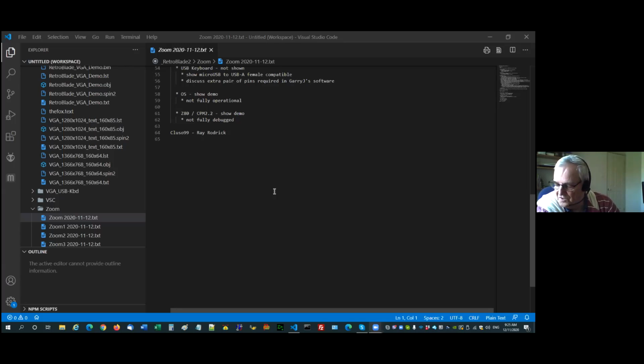Also, just to make sure it doesn't boot from the flash, in case you've got code on there, if you set switch 3 on, which pulls P59 high, it will stop it from booting. Now, I think when you stop it from booting, the P2 eval works. I've got it, but on my board I don't have that optional pull-up. And if I've got an SD card in there without the boot file, so underline boot, underline p2.bix, or the boot parameters in the volume label or boot label sector, it still takes time, so it actually won't see the board. As soon as I pull the card out, it's fine.